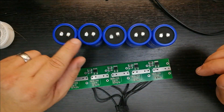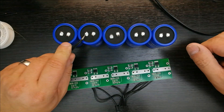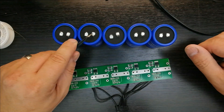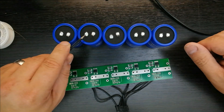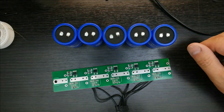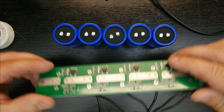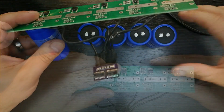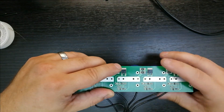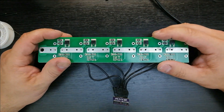Now, if we look at the top of an Amprix capacitor, the positive has a smooth top and the negative has a waffle print on the actual pin — that's how you tell positive from negative. Smooth is positive. Here's our positive on the board. Let's fit them on here. All five of them basically fit, so let's tack them down now.